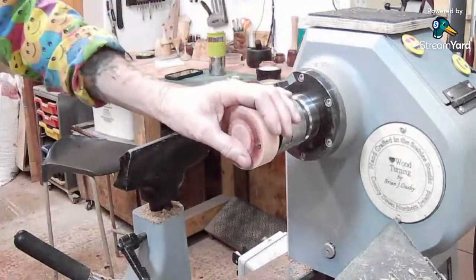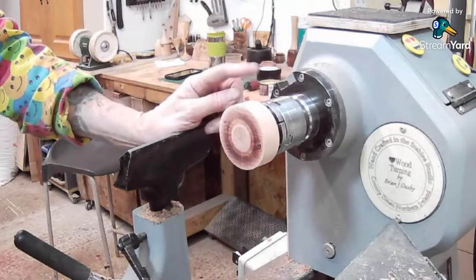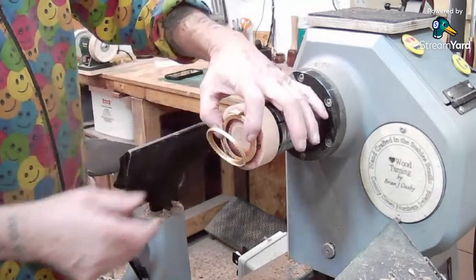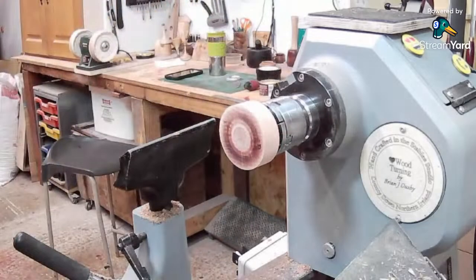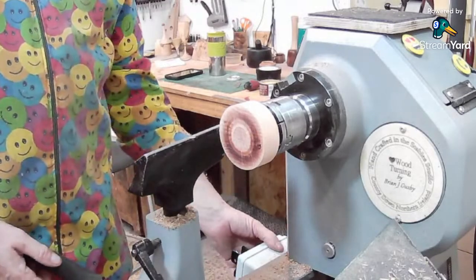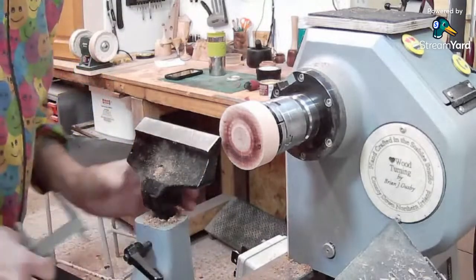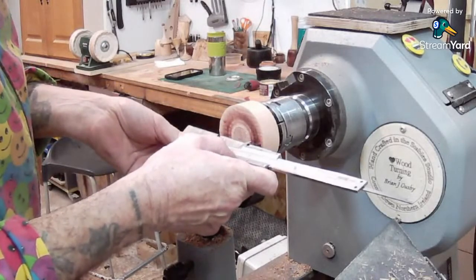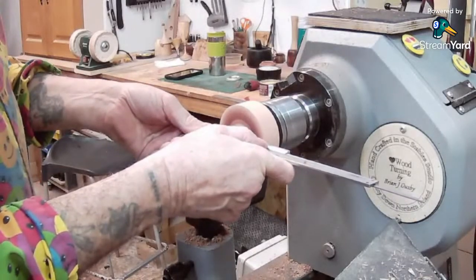Do I? No. Is it not on a tenon in there? It's on a tenon now. So I need to make the tenon for this ring. All right. Yeah. You make a tenon for that ring, and then inside that tenon you make a mortise that you're going to put on your chuck where you turn the top of it. Yeah, okay. And then you can dome it slightly. So I need to do this inside first. I need to do this first. Make it 54 mil, before you just start. Sure that's 53 mil. 54 mil, that's perfect. So let's try and get this in.